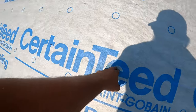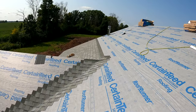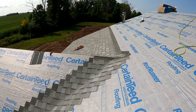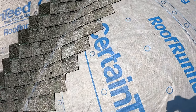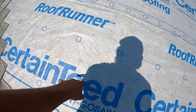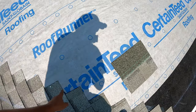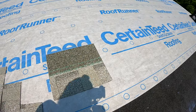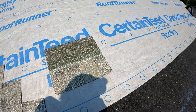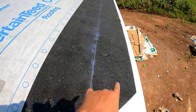This will be the top of our shingles. Each shingle is 11 and a half inches wide, so we just multiplied that out. In this case we went to 46 inches, snapped a line, 46 inches down from that line, and 46 inches down from this line, so on and so forth. You can do every row or every other row, and then we have determined our second row of shingles from the bottom.